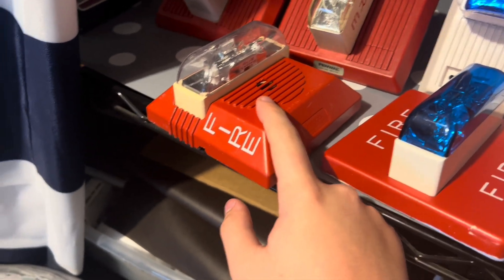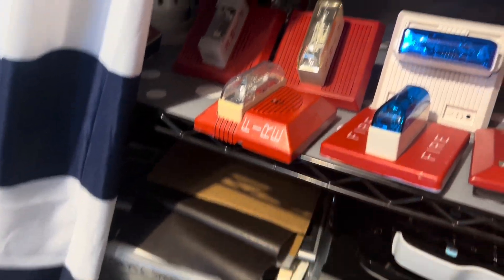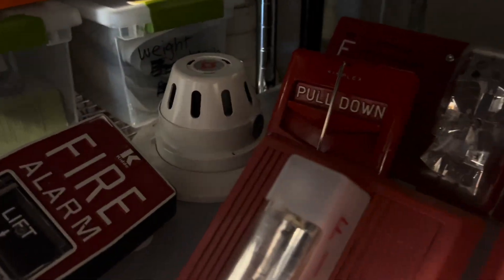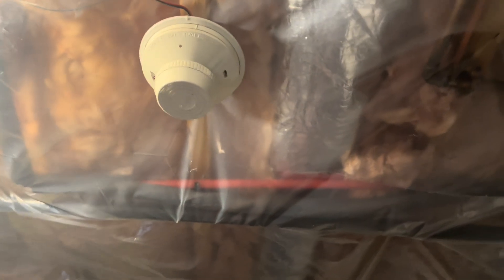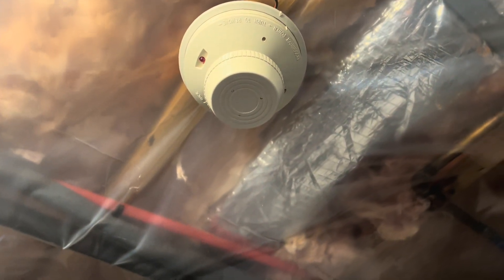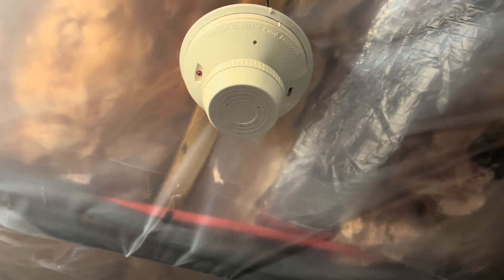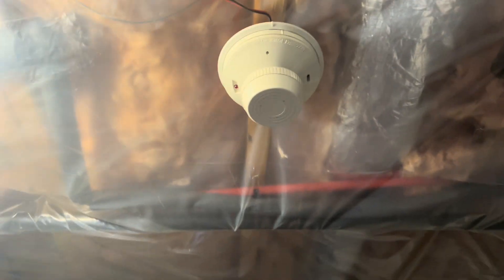We have 75 candela — this is the RSS now because I swapped the plates on them. You also saw my Wheelock NS; haven't used this in a system test yet, at least I don't think I have. Collection shelf — you can see the wiffle balls right here. On the ceiling we have what looks like a System Sensor 1400, but it's actually an FCI SBS-1101 — basically a System Sensor 1400, just a rebrand.